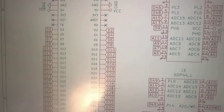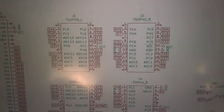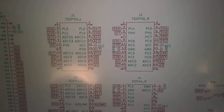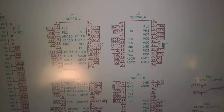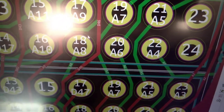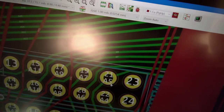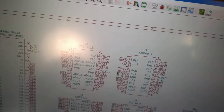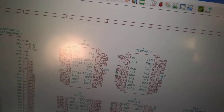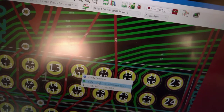Wherever the A11 pin is. I also need to make sure that when I cut the traces to A11, I don't also end up cutting off A1. Let me bring up the PCB. You can see here on the leftmost adapter — I already forgot what pin it is, so we're looking for pin 15 or ADC11. This is the updated PCB, not the original. I thought I had it backed up but I was clearly mistaken — but it doesn't matter, it was broken anyway. So it's 5th from the bottom.